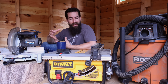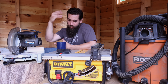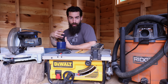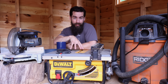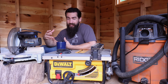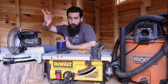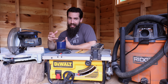Here's the deal. We all think bigger is better, and with some reason. Every cabinet shop you've ever seen, every professional furniture maker's shop has a cabinet saw, because it has more power and allows you to break down larger objects like sheet goods or slabs more efficiently and frankly safer than with a contractor saw. However, they're expensive, they take up a lot of space, and they're not always the right fit for what you're doing. Just because somebody who's doing something different from you, maybe has more experience, maybe is making larger objects, uses one, doesn't mean that you need one.